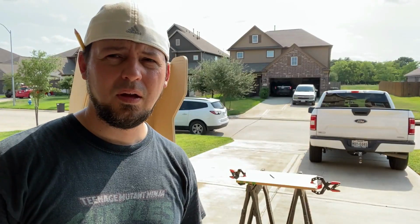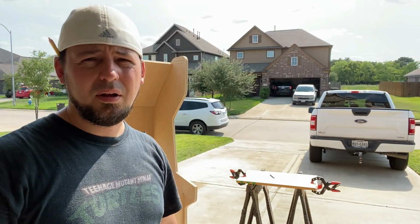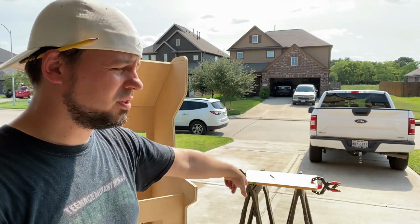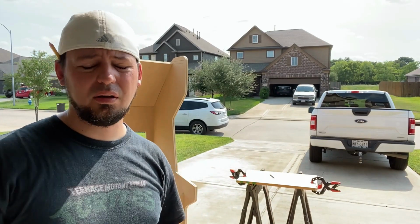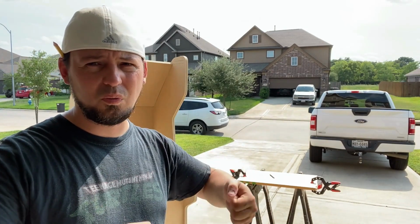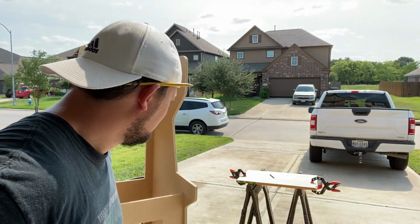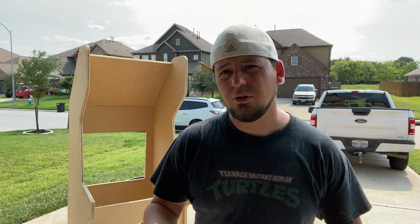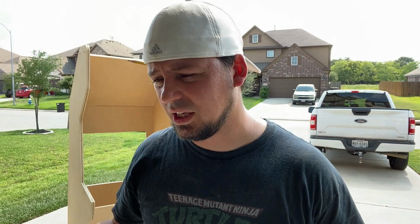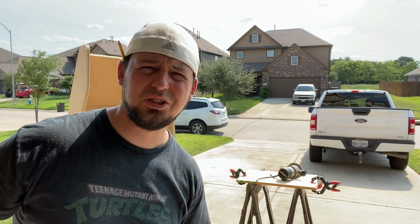I don't know if you can tell, but basically what I've done is I've anchored that top panel with those clamps to another heavier piece of wood, because taking the router over it, the weight of the router is going to push it down. So just, to be cautious, I guess, I went ahead and did that. So hopefully it'll stay put. Side note, you don't want to bank your safety on a hopefully, right? So maybe I'm not being smart about this. I've done this before. It should stay put.